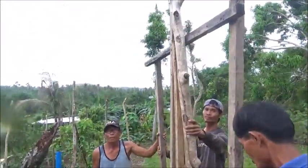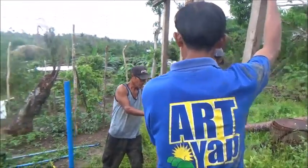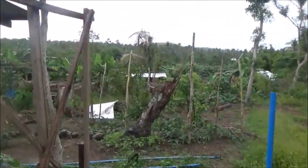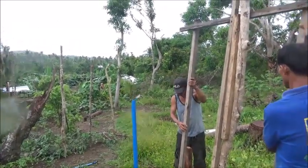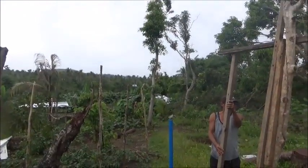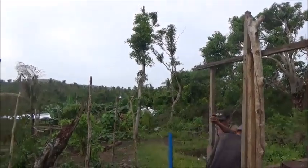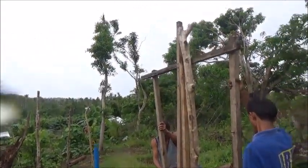That's more than 2 inches, but I think that's okay, Tatai. Just connect it and it's good. This way to the left is south, and they need to be angled to the south. I think 7.5 degrees is what Tracy told me. I think they're going to get an easy 7.5 degree angle here. It'll be pretty close.